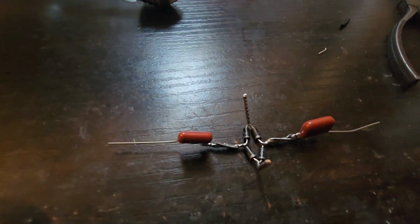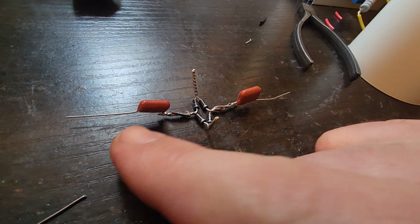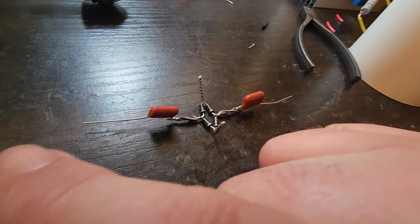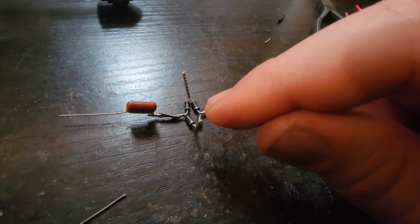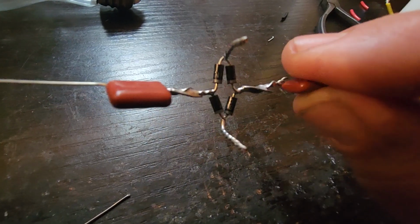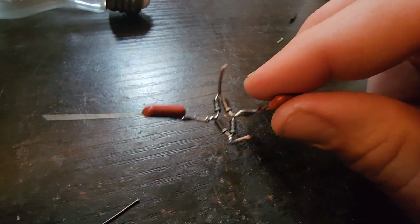It's composed of 1N5817 diodes, and on the AC side we have a series film capacitor coming off, which is RF, and it's a 1 nanofarad. And I like to fold the DC legs up of my rectifier, so that way it's convenient and I can tell where the DC is.